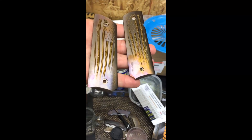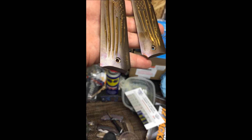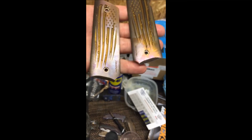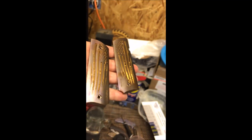The design I'm working on right now is the Battletorn flag design that I've been doing on some knives. You can see this set here in bronze — I still have to sand the top. This is a 4% step over with that same end mill, noticeably coarser lines, but it's still turning out really nice. When I get these grips finished up, maybe I'll roll in some stills at the end to show you what they look like. The 6-flute finisher is sick — loving it. Thanks for checking them out, guys. Catch you later.